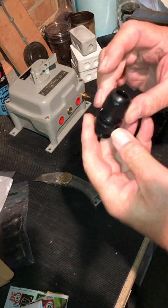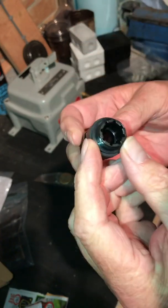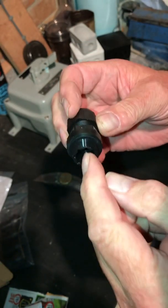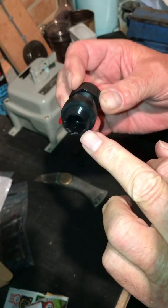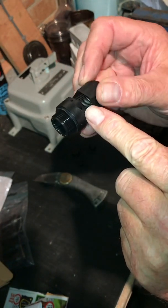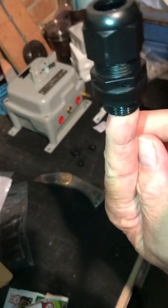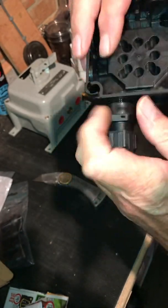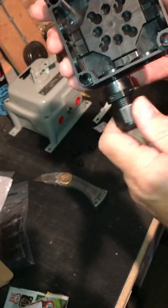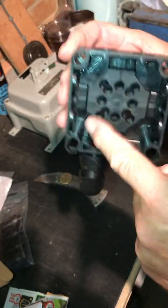The other choice is this — the vent gland. This breathes through the side once you've got your cable in. These slots allow the airflow in through the holes all around the edge. Obviously I'm not going to be using them facing upward — I'm going to be hanging them out the bottom of my box at the lowest point. Same with any vent, we want it facing downwards, and these will allow ventilation to circulate through my box.